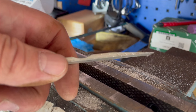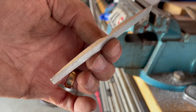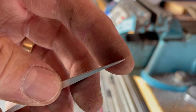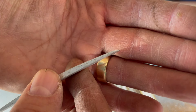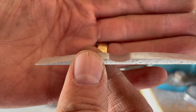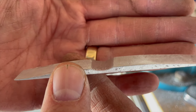You're going to repeat that on your other end — which I won't bore you with, so by the power of YouTube — it's done. What's critical on this is you have thin edges, and that radius you've made in there approximates to the radius of your rollers on your door track. We'll go and have a look at that now.